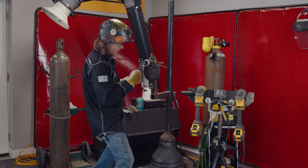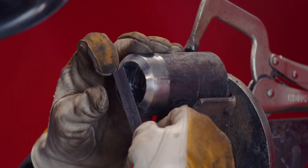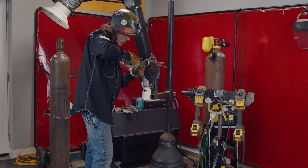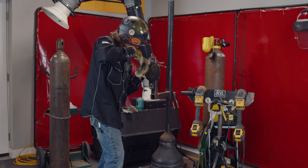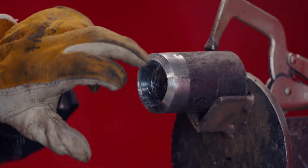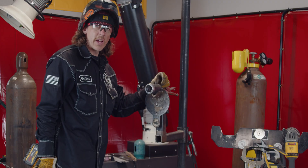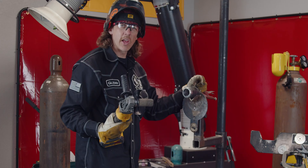Grabbing the ruler to check some dimensions. I flipped it to the 64ths side of my ruler, put the point in at about a 45-degree angle, and swing it back and forth until I find my farthest point across the pipe — looks like 50/64ths. I grab my file and pull the burr out with a back-and-forth motion. Then I check the inner diameter of the other pipe with the same ruler to see the difference — how much farther I need to go. Looks like 10/64ths, so I'm off by 10/64ths, which is 5/32nds. I'll hit it again with the grinder, clean up some of my marks, and start moving it out slowly now because I'm getting close.